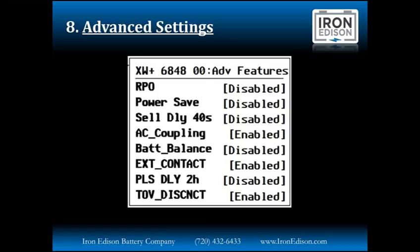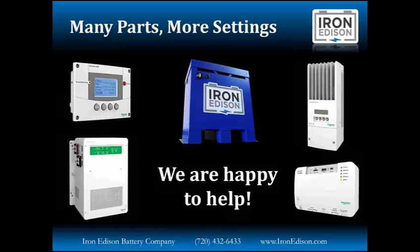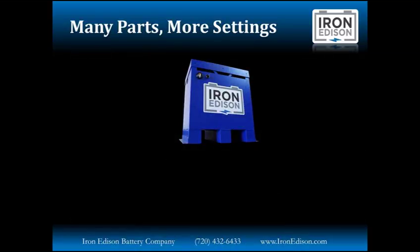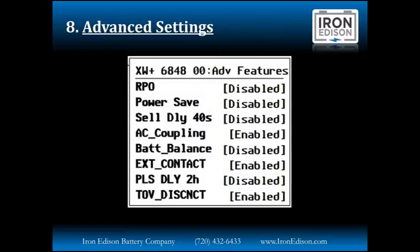Peak load shave delay and TOV disconnect are the last two inverter advanced settings. I'd like to look at the TOV disconnect, which is transient over voltage. Last night I was at a Senate committee hearing talking about the safety and operation of the system in a configuration where it's tied to the grid. Somebody from the utility expressed concern that as the voltage on the system rises, the inverter may not shut off.